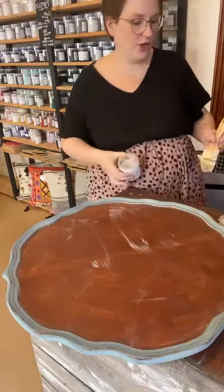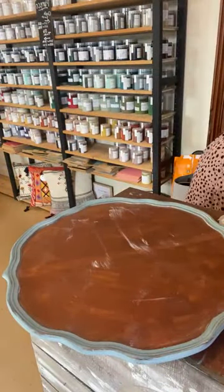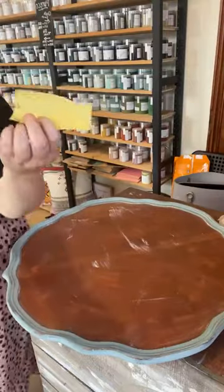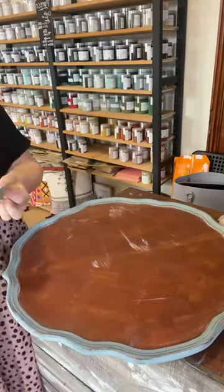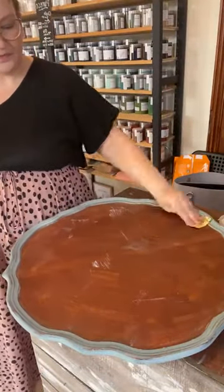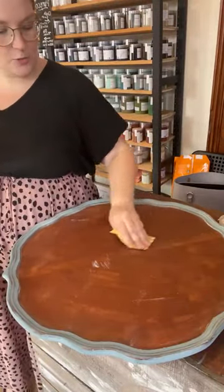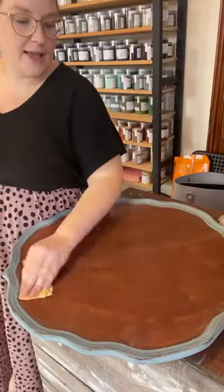And then what we're going to do for the timber, and this is my favourite thing to do with timber, I do it with hemp oil and with wax. There's no point showing you, it doesn't say, 1000 plus grit sandpaper, the finest you can get. And then I just really gently, you can really go in any direction, and you're letting the wax and the sandpaper do the work. You're not putting any elbow into this. But you're just really, really gently sanding.